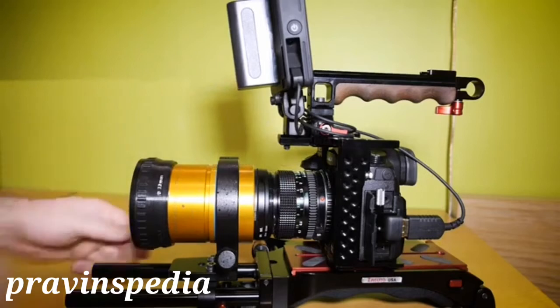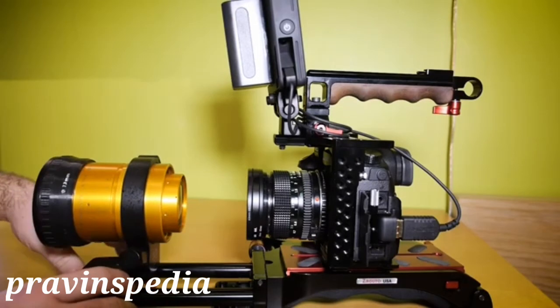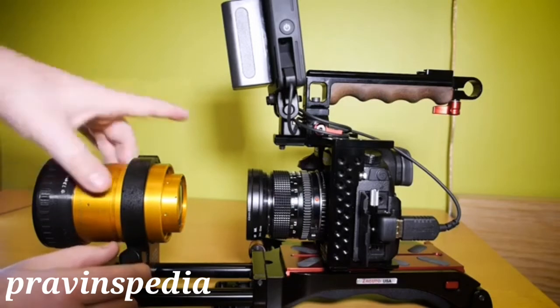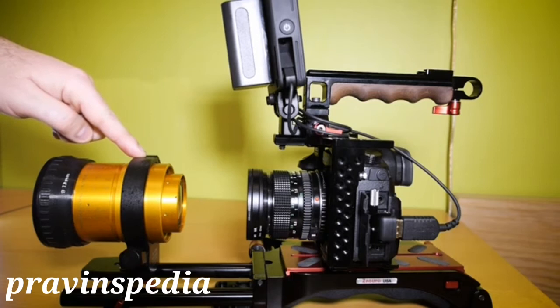So I did it a little differently. The cool part is, if I loosen these screws on the rails, I can slide the anamorphic lens forward. And if I need to align this lens, I unscrew this screw and can turn the lens in the lens mount. But with this style of clamp, I probably don't have to align my lens that often, which is really handy.